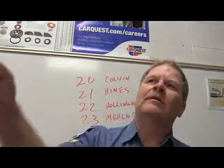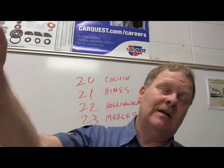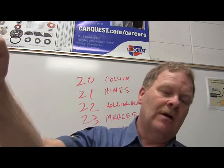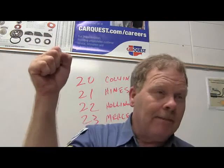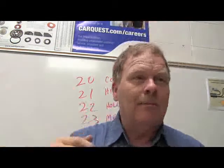Okay, but let's be honest here. Basically, this question should be prefaced with, when you have a choice, you should always pull the wrench instead of push it. Of course, you need to pay attention to what's in the way too. If you pull the wrench, you have more control when it comes loose all of a sudden. If you push the wrench, you've got all your weight pushing you, and you're probably going to plow your hand into something and open it up.